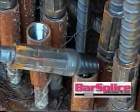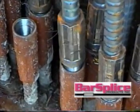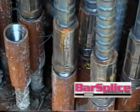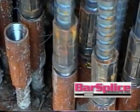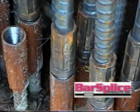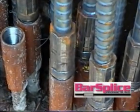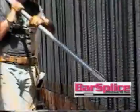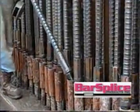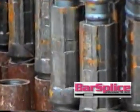For pre-planned mechanical splicing of reinforcing bars, threaded couplers are a natural choice. New construction is the ideal application for the grip twist taper threaded system. Couplers can be attached to the bars ahead of shipping to the project site. Rebars are ready for placement when they arrive on the job site, saving time and field labor. The self-locating and quick locking nature of the taper-threaded ends allows for expeditious assembly of the grip twist system in the field. Rebar congestion and placement problems are minimized.